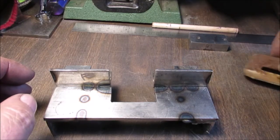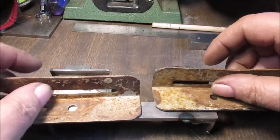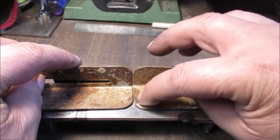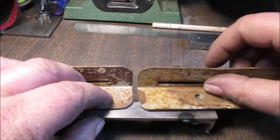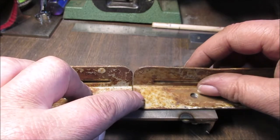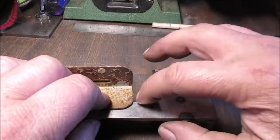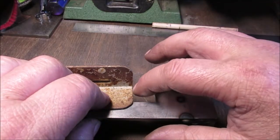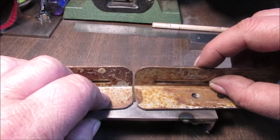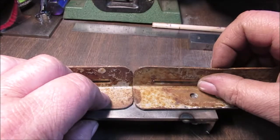Okay, we have two fans going, so excuse me for that. I know this is rusty, but here's the idea. You really want to have that perfect. I mean, then you know there's nothing under there, right? So you can put it in here and clamp it. You can spot weld back here, and then you can flip this upside down and spot weld there, or right on the top. You know, it might be something that you don't care if you see the weld on this side, on the inside corner. You might be making it look nice out here, so you got that option.